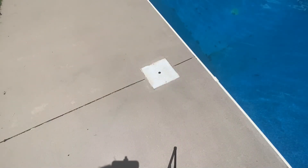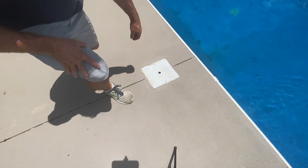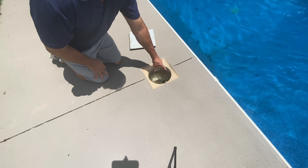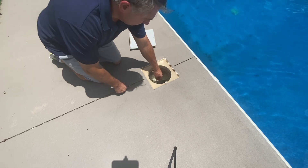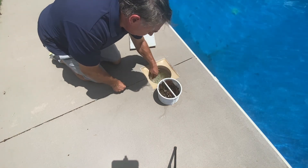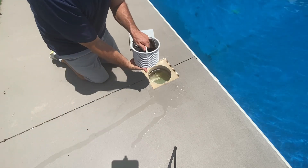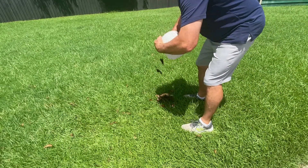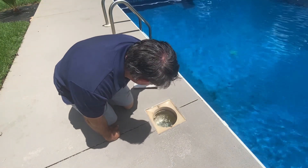Which is a perfect time to tell you about this little door right here. Before we dump this water out, I want to clean that screen out. All you do is take the cover off and carefully reach in — sometimes you'll find some critters in here, so you have to watch it. You may want to invest in a little hook to try to retrieve it. This is what collects the large part of the leaves. If this basket is hard to tug out, simply turn off your pump — it releases the vacuum on the bottom and then you should be able to easily pull the filter out. Then just dump it out and push it back in its slot and put your cover back on.